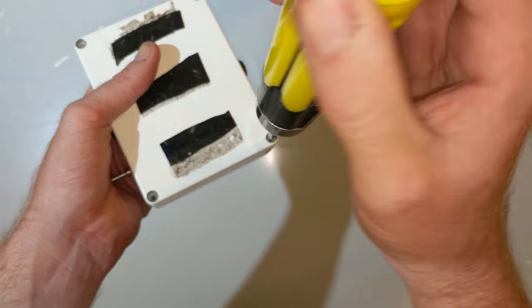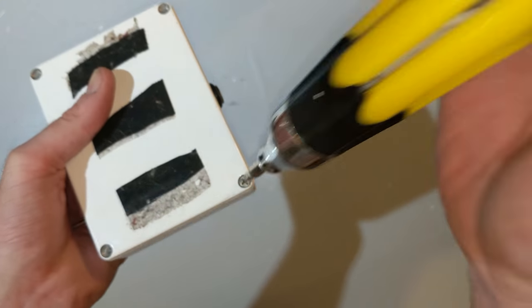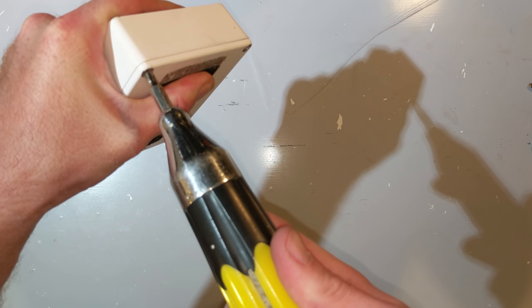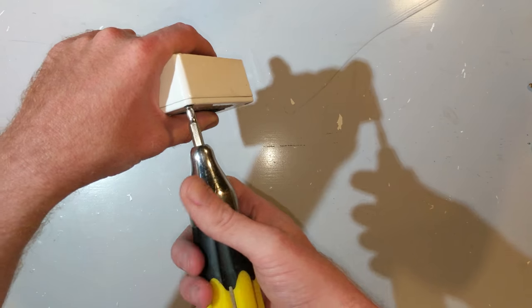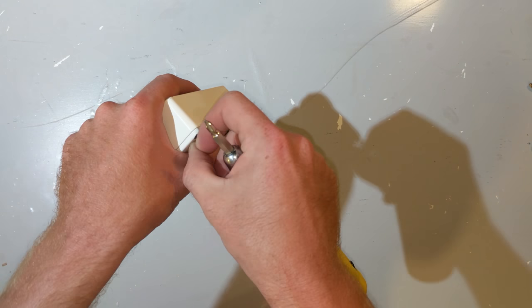And for the first time, I decided to take things a little bit beyond breadboards and perf boards, because that was one thing that gave me so many issues. When you're trying to do something like a high gain audio circuit, you get issues when you work on a breadboard because of all these stray capacitances and everything's acting as an antenna. It gets very hard to work with and actually get any idea of what your final product will be like.